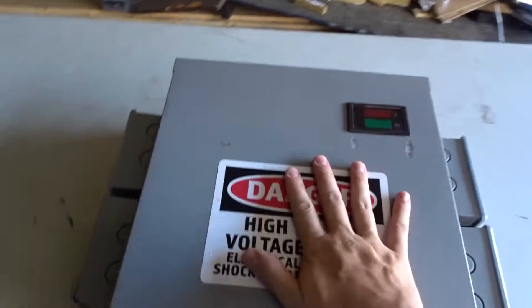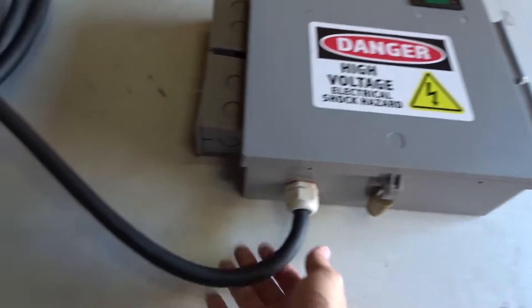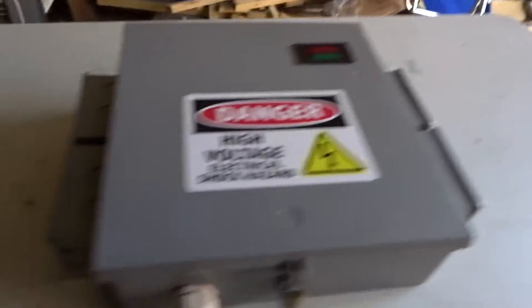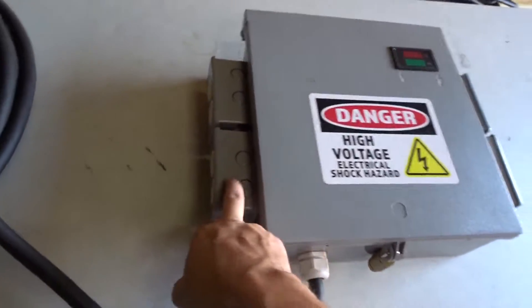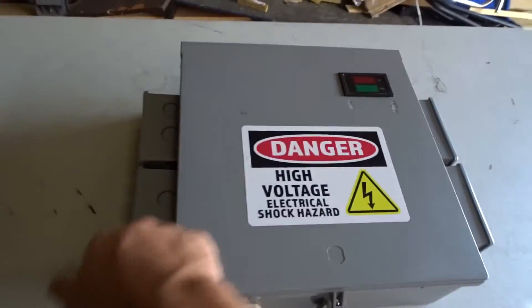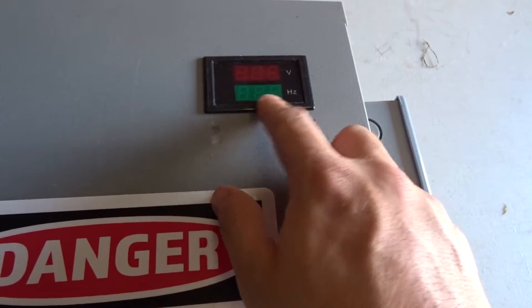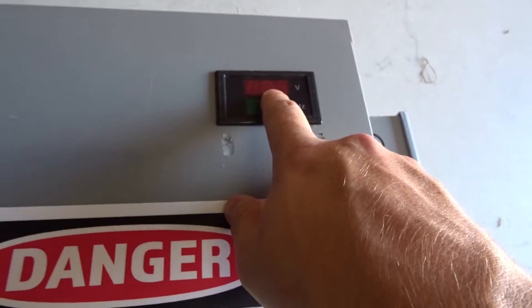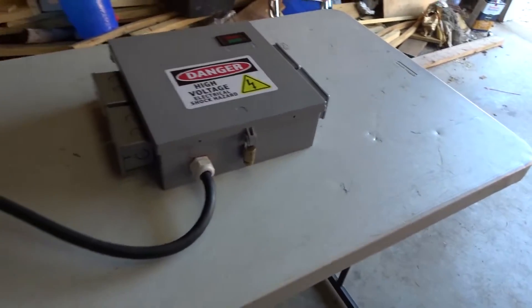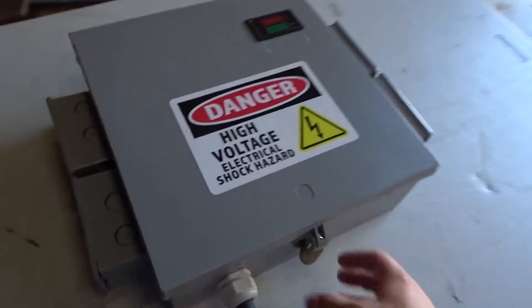Here is the distro box I built myself. Technically it's not high voltage, since that's above 1,000 volts, but I want to keep people out of it — I have a lock on it so you can't open either side. My cabling comes in at the bottom. I have two duplex outlets: the black ones on one side and the white ones on the other. Each side is one leg of the 240 volts coming in — 120 volts on this side and 120 volts on the other — two separate circuits off each leg. On the front I have a voltmeter and a frequency counter so I can tell if the generator is running at 60 Hz and has 240 volts.